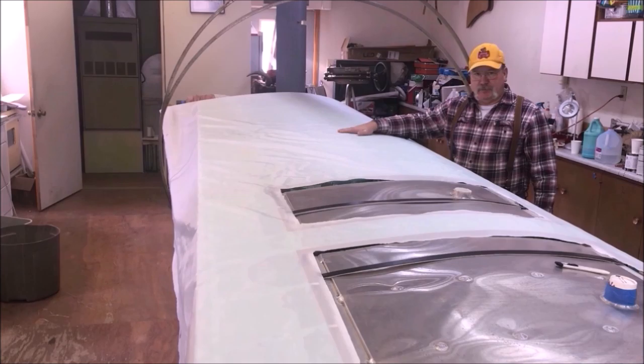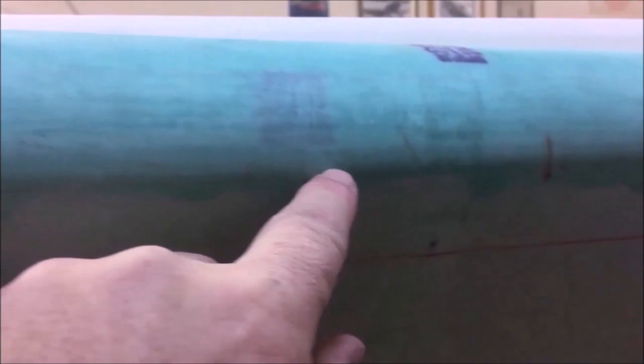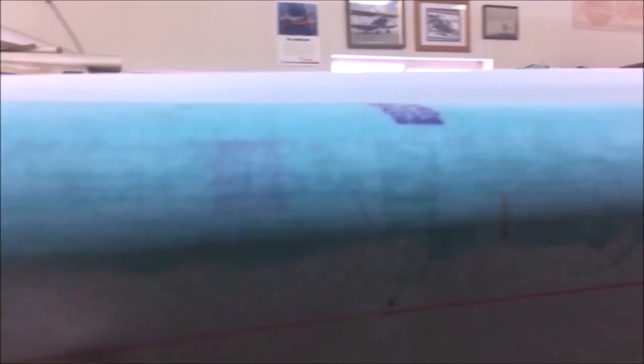So okay, as you can see, I've sealed my undersurface also, but I'm bringing this fabric down to this line right here. There's my underlayment of fabric on the original SF-102 fabric. This is 104. It's going to come down, and you can see it. The way I do it is a little different than a lot of people do. I like a pinked edge. Some people like a straight edge. If you like a straight edge, go ahead, cut your straight edge.